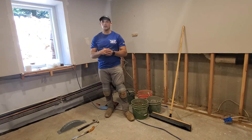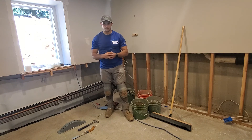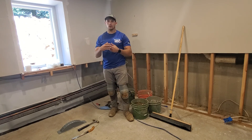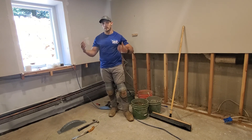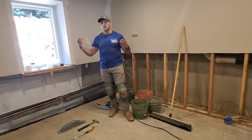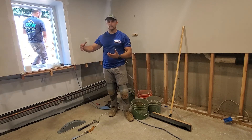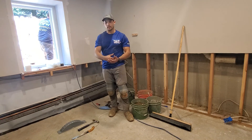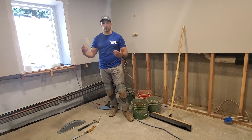On this project, a customer gave us a call and said they're getting a lot of water through the egress window and it flooded out their basement. When I came and inspected it, I noticed there were multiple things wrong with the previous egress window installation. First of all, they used railroad ties to hold the earth back. As a result, water was able to seep in between the joints of the railroad ties and enter into the pit for the egress window and get into their basement.